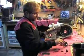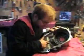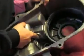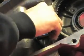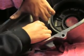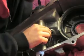That's this piece right here, and it goes in the transfer case this way — it goes in that hole right there, if you can see that. You've got a couple of plungers and a plunger here. Take this piece like this, carefully slide it in, relax this piece — it goes right in. You should have that orientated right there.